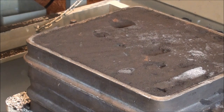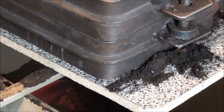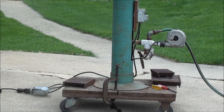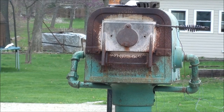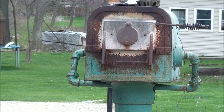When I go to break it open or shake it out a little while after I pour it, it's in the correct place — it's on the molding bench so the sand can fall through. A major mistake I made was using that real slick molding board, because it's like working on ball bearings. I've got the Johnson Furnace running — it's actually a heat-treating furnace, but I use it with a steel crucible. It takes 110 volt electricity and natural gas.